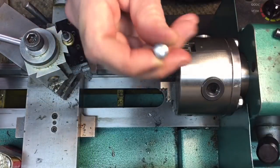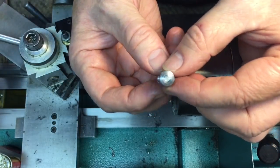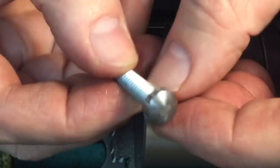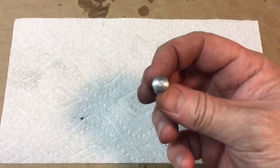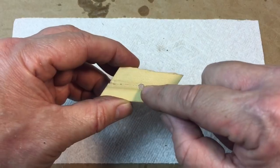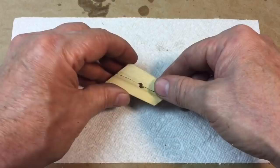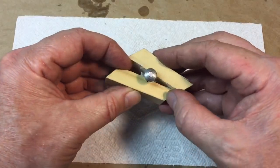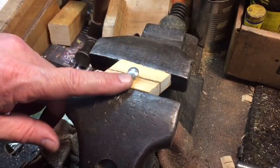Take a look at this — see how nice that looks right there. So now we just have to cut a slot in there and that will be a good-looking bolt. We took a piece of scrap wood, drilled a hole in it just a little bit smaller than a quarter inch, and then split it in half. That'll be our jig to hold the threads without messing them up — it gives a nice soft way of holding the threads in.